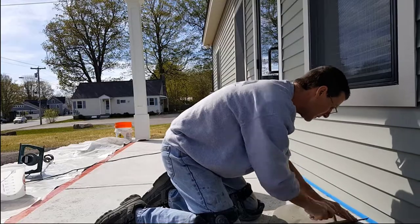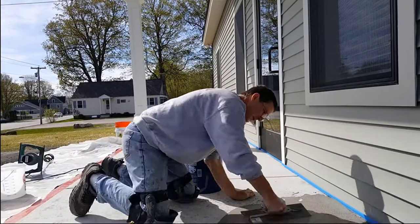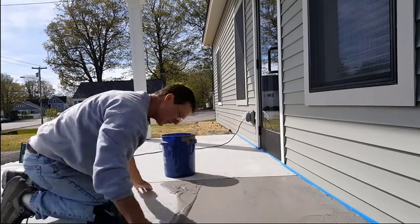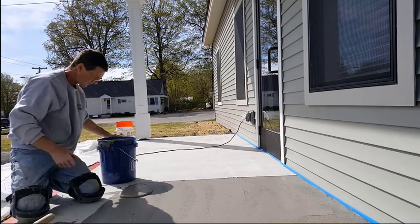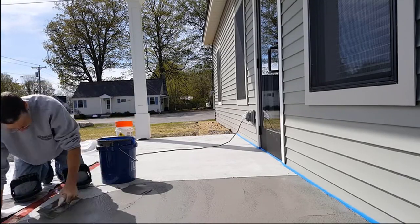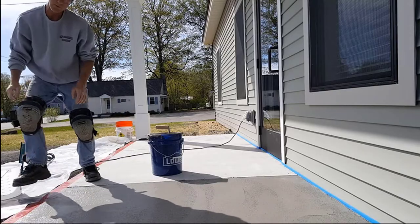As you can see, you just dump it on the dry concrete and you're going to want to work in sections. I'm going to do that first section up to that groove line — trowel it in, pressing down pretty hard. You want to push it down into the pores of the concrete. When I say trowel it down tight, I mean I'm just troweling down about a sixteenth of an inch of that stuff, maybe a little bit more. I don't want to leave a bunch of it on the surface — just enough so I can get a good broom finish. It does dry pretty quick, so you're going to want to get it down as quick as you can, but put it down really nice and even. As soon as we get it troweled on, we're going to broom it right after.